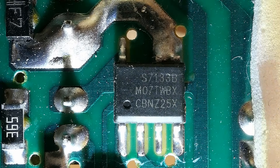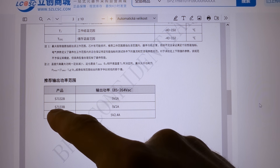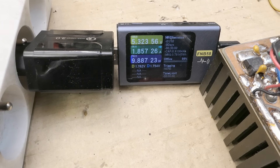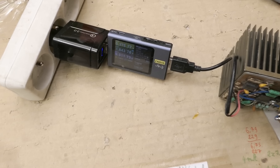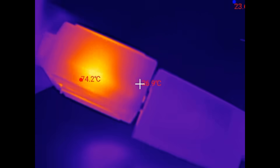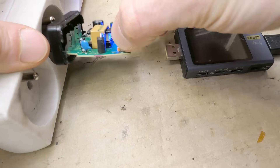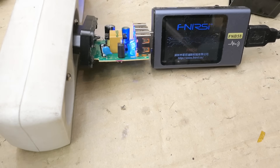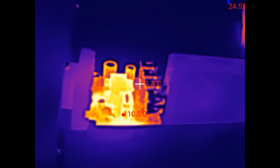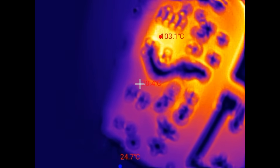Looking at the markings of the primary chip datasheet — the version in this charger is 33B, intended for 5 volts 2 amps, and it can't even do this. Let's leave it running for a while at maximum current — it still works after four hours. And of course some thermal imaging: 73 degrees on this side, the diode is the hottest at 100 degrees, and the chip is 103 degrees Celsius.